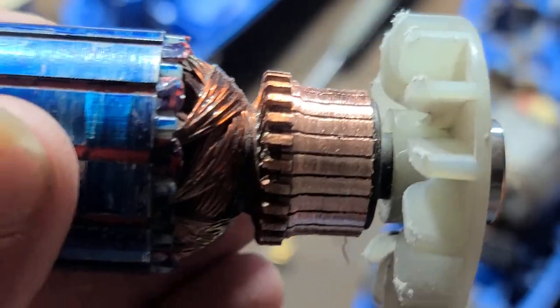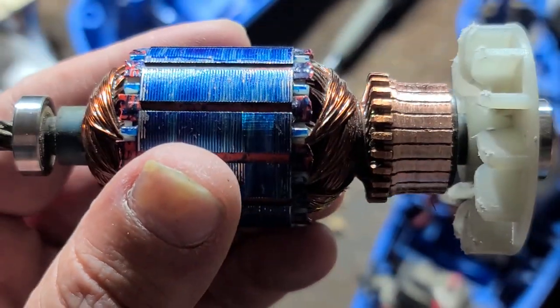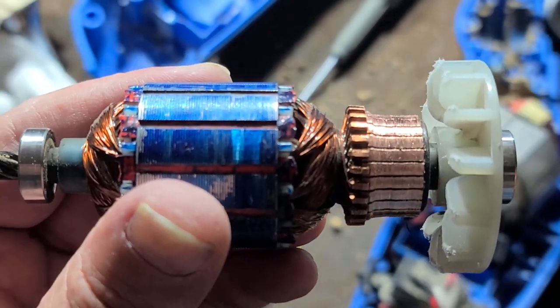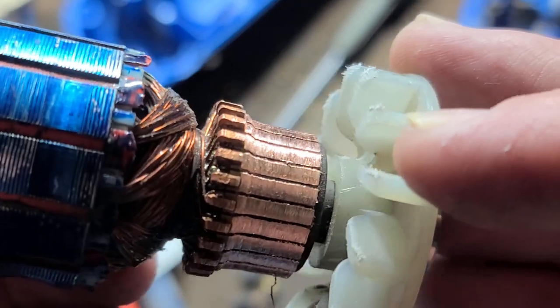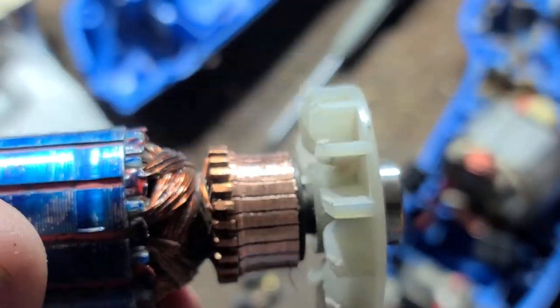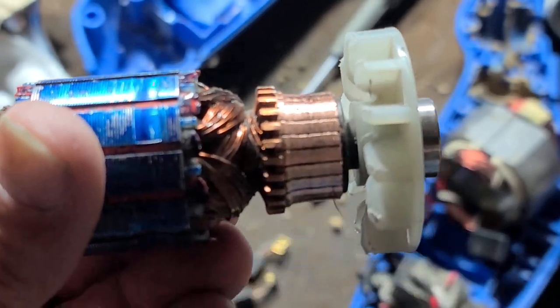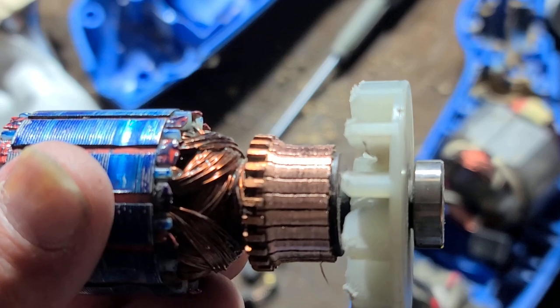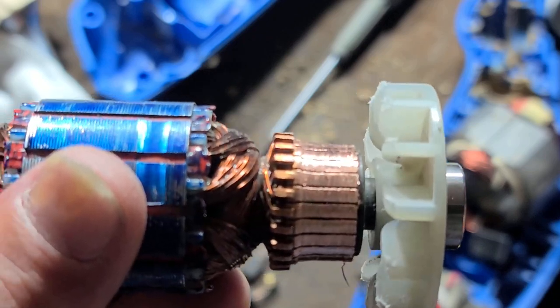It's also much more difficult when you're by yourself, because you have to hold the drill with one hand and manage fixing the commutator with the other. If anyone can help you, it's dramatically easier — that person can run the drill while you focus on restoring the commutator. This one with the fan is making it a nightmare, a much slower process. Far from perfect, but this was one of the worst motors to try this on.